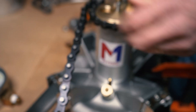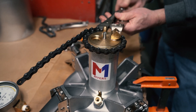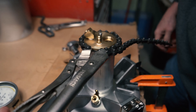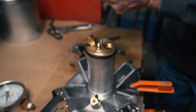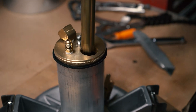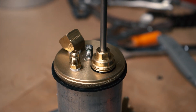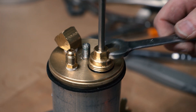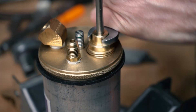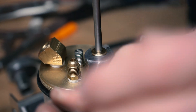Here you can see we're tightening the chamber just enough so that the 45 degree elbow sits between the two clamp assemblies. This will ensure that your air meter sits firmly and flush into the case. Next we're going to be putting on our super pump. Here we're using a half inch wrench with some nice downward pressure to get it seated firmly first, and then continually turning clockwise until it is firmly flush to the top of the cap.